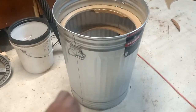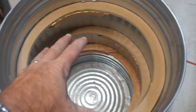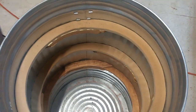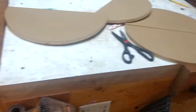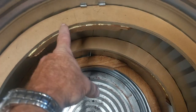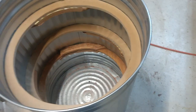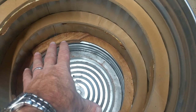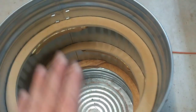So I went out and bought another one of these things, and this time I'm going to reinforce it before I start using it — just by adding ribs to the inside. Nothing fancy. I built three ribs; they take about 10-15 minutes each. I took some half-inch plywood, drew some circles, took them to the bandsaw, cut out half-circle strips, laid those together with a piece of wood underneath, glued and tacked them down. They graduate to about 18.5-inch, 19-inch, and 19.5-inch diameter — equally spaced.